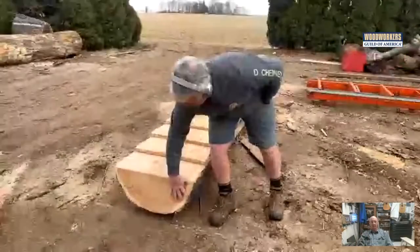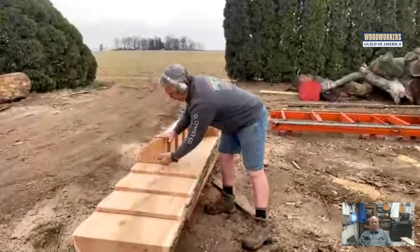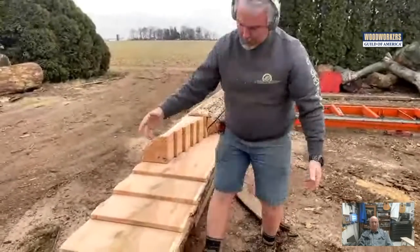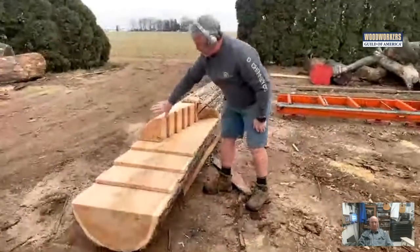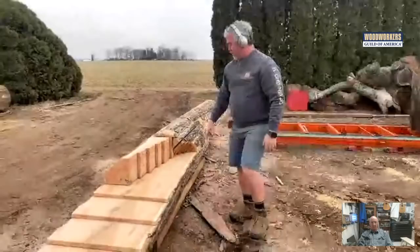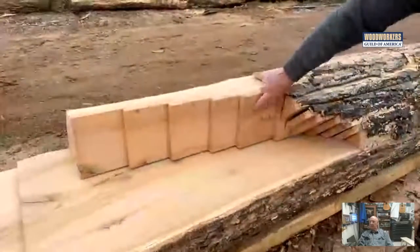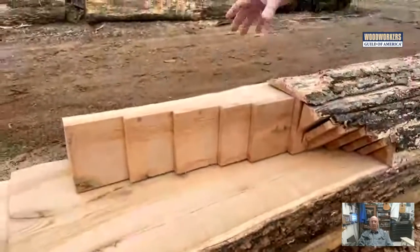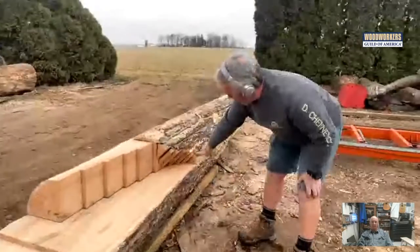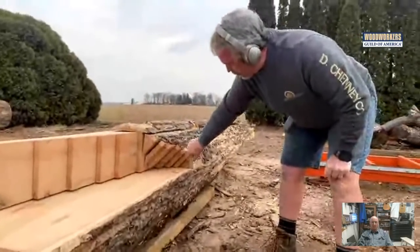But once I get to this section, this whole half round, I would have had a hunk. This upper section would have been left over from making cuts 2, 3, 4, and 5. We put this chunk, which looks like this one, on the mill and we turn it 90 degrees and we take that grain again being 80 to 90 degrees to the cut. And hey, if you can swing around here, we're seeing a little bit of that fleck on that quarter sawn oak. And then we're left with a pie shape, which looks just like this guy here. And then we'll put it on the mill at an angle and we'll cut these pieces 80 to 90 degrees to the growth rings.